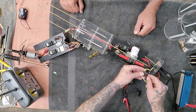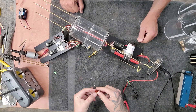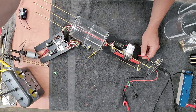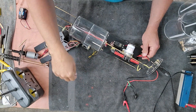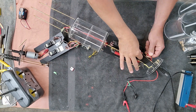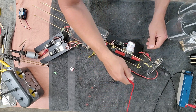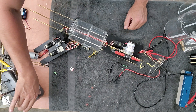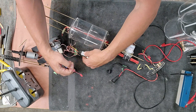Nothing. Check the fuse. The fuse is blown. So we've got to replace the 10-amp fuse. Blown fuse. But for fun, we can connect power past the fuse. Still nothing — no power even when we bypassed the fuse. I'm going to power up the receiver directly.